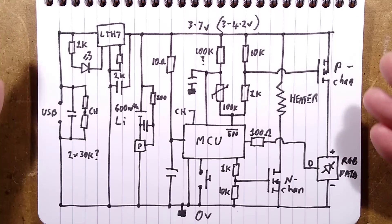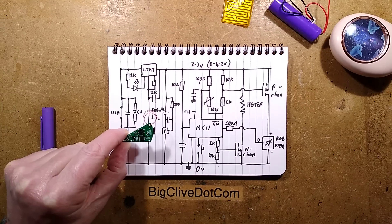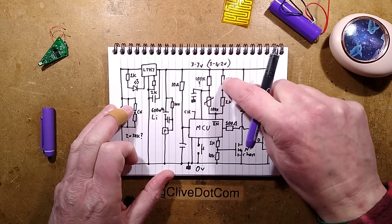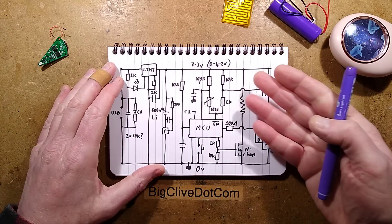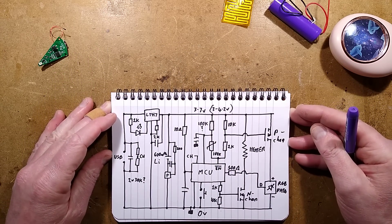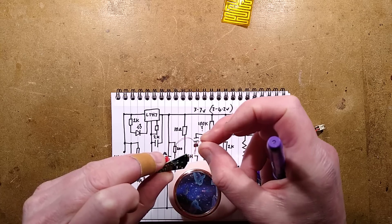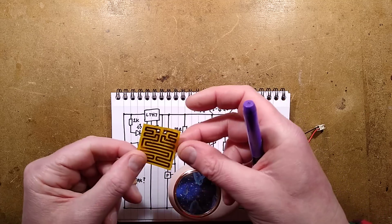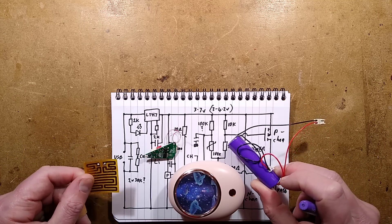It's quite a nice circuit — quite a complex little circuit. They've jammed it into a very interesting-shaped circuit board. It's nice because of things like the extra protection. This is also a good example of how you can save on losses while the unit is asleep by turning off external circuitry. Strange how they use thin copper wires — I guess they've got low thermal mass, and also cheap. Nice enough little heater, could be useful, but hobbled completely by this crappy lithium cell.